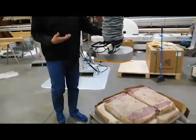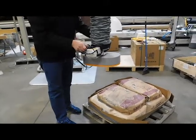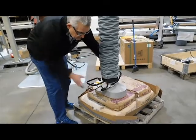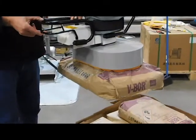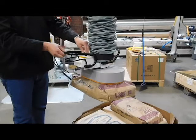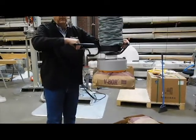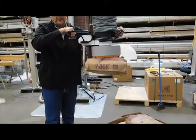The vacuum is always on, so vacuum is always down to the suction foot. Push the down trigger onto the bag — you want to pop it down to it. Let go of the trigger and you can see it start to suck to the bag. At that point, squeeze the trigger and go up. You can adjust the balance position by turning the knob. You can go hands-free — it's floating — and still squeeze the trigger to go up or push it to go down.